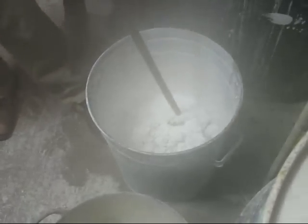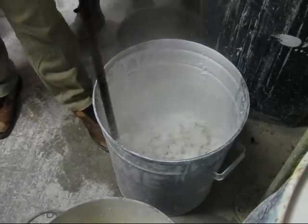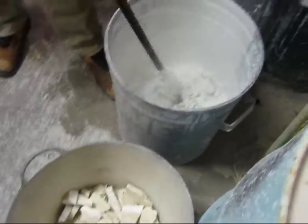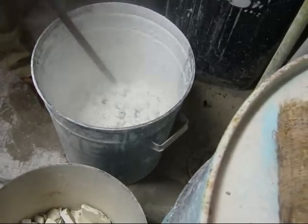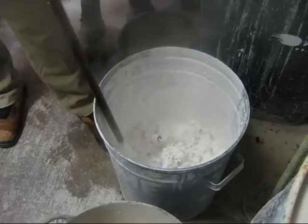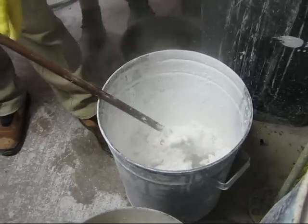So you put the sand in first? Yeah. It's got to be dry sand and rock lime. How much does the lime expand when you add the water? Well, it doesn't really expand — it just absorbs that water. So it's only absorbed the water that's in there. So you can see that's how the plaster lime or the hydrated lime is made.